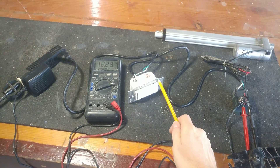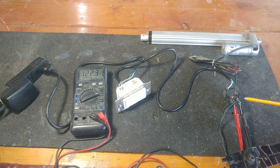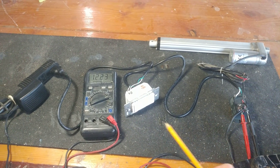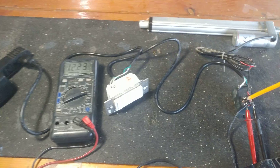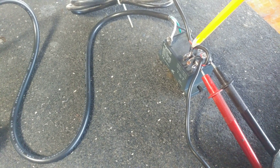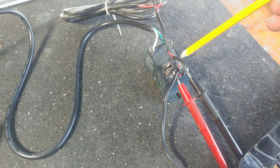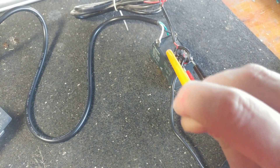So I took a Z-Wave controlled smart switch and a 120-volt controlled low voltage relay. It's a double pole double throw relay, nice and simple. I've got my 12 volts here off my DC power supply to the center two pins of my relay, and then the top one here does an X to this one for the negative, and I have the other side here — the positive — coming through here down to this side. So when the relay goes back and forth the polarity reverses just like this.